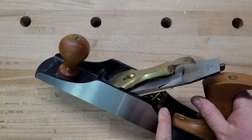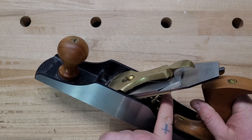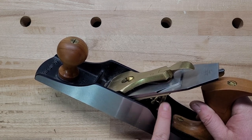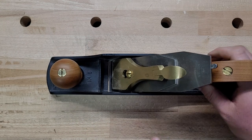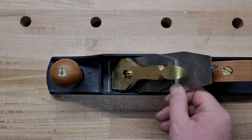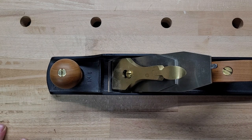You always do want the blade to be in the advanced position, but more important than that is the cap and the screw. If it is not tight enough, you will experience backlash and you will have issues. I hope that helps. If you have any questions or need a quick video like this, feel free to shoot me a message and I'll help you out.